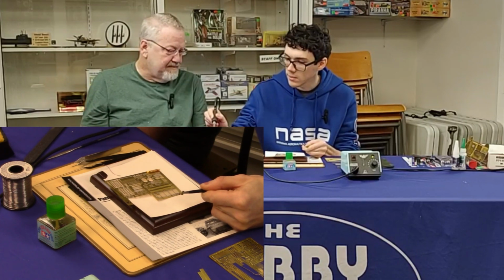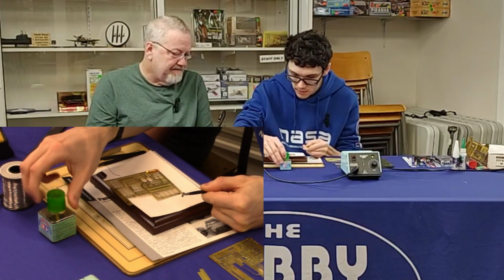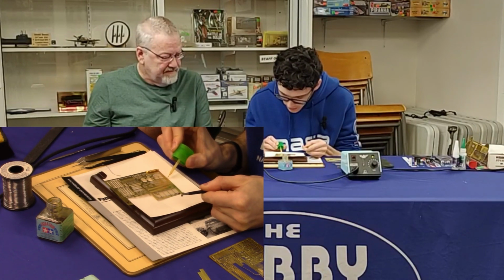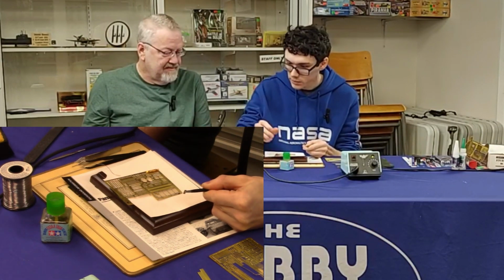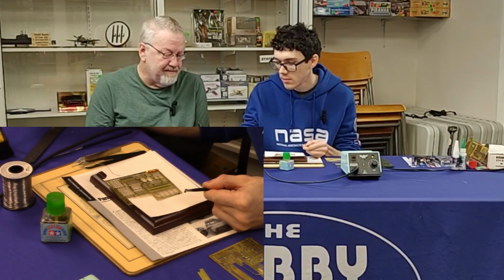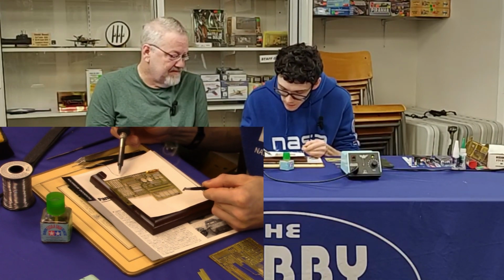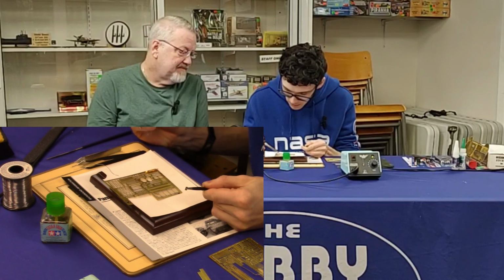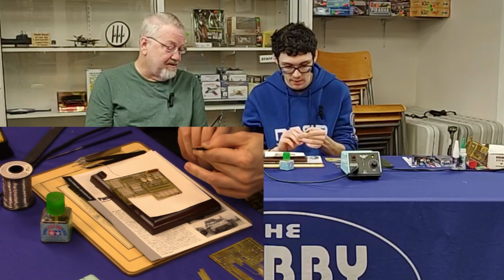All right. Okay, so the next step is to tin the piece you're going to solder to, so the runner. Just along there? Yeah. Right here. There you go. Clean this off, or actually... Yeah. It's always best, every time you apply it, you should clean it, because there will be some kind of slag on it. All right. And you can solder, tin that piece now. There you go. And you can see by increasing the heat, you can see how quickly that flowed.